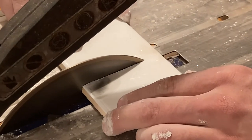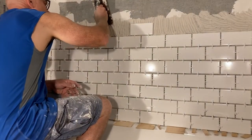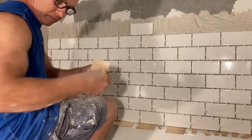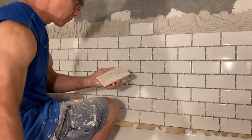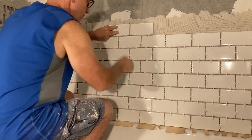You can see here we're cutting the tile. Subway tile cuts relatively easy. That saw we have there is about 25 years old and it works so well. We mixed up the thinset — a good rule of thumb is if you throw the thinset against the side of the bucket it should stick, which tells you you're not making it too loose or too thick. If it were either, it would just drop back into the bottom of the bucket. When we put the tile in, we've been putting a run of mud on the wall and then gauging it with the trowel.